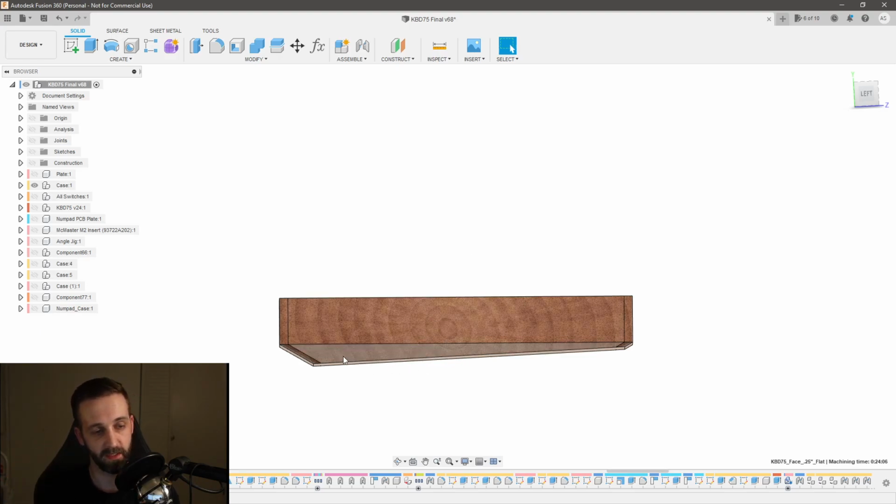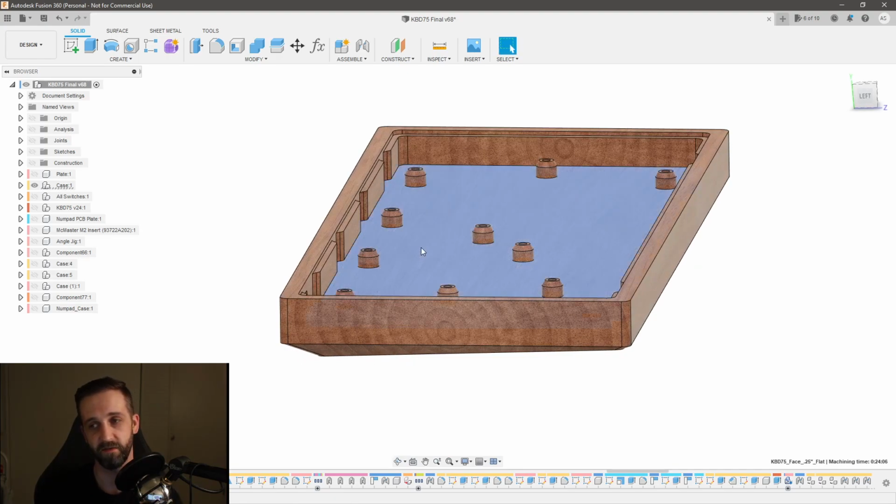And that means that we actually cannot machine this backside first unless we're able to hold that backside at a very specific angle. Now, I am not a particularly competent manual machinist, and so I wouldn't be able to set up the parallels or a sine bar or anything like that to get that angle dead on and machine it that way. So constraint number 1 that we're running into is we've got tapered and non-parallel surfaces, which means we're going to have to find a way to machine this side first.